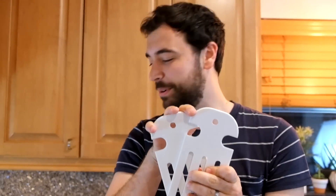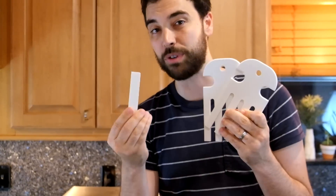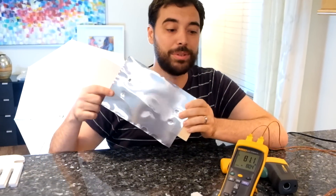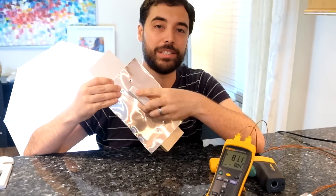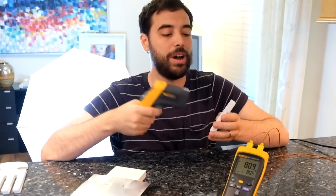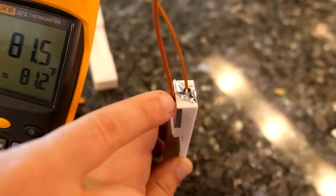So now we have the final shape done, but we've never done any heat forming before, so we have some test pieces we're going to run some tests on. We're doing two things: one, we're going to see how this forms when it's heated to temperature, and two, we're testing if this infrared thermometer works well to read the surface temperature of this Corian, compared to two thermocouples — one on the surface and one inside. We need to heat this entire thing up to 300 degrees Fahrenheit for it to bend successfully.